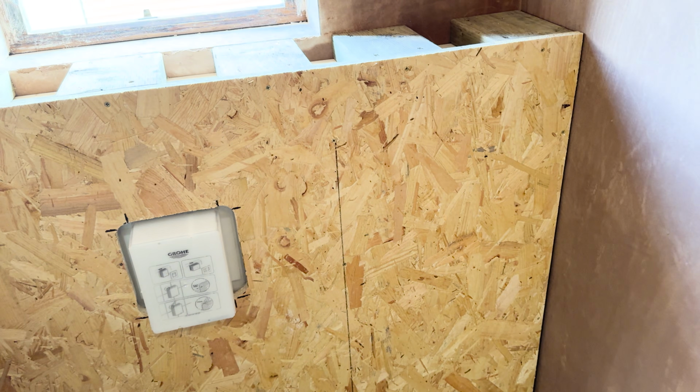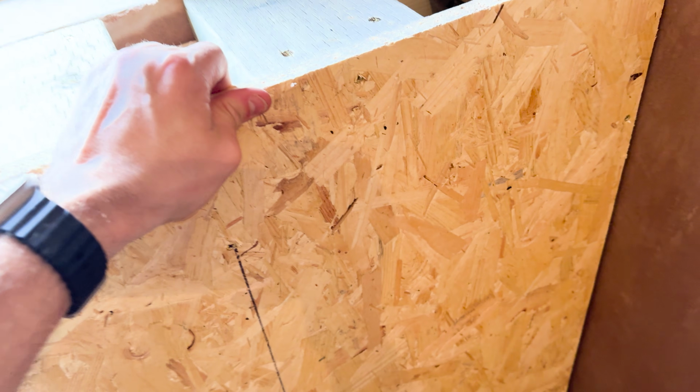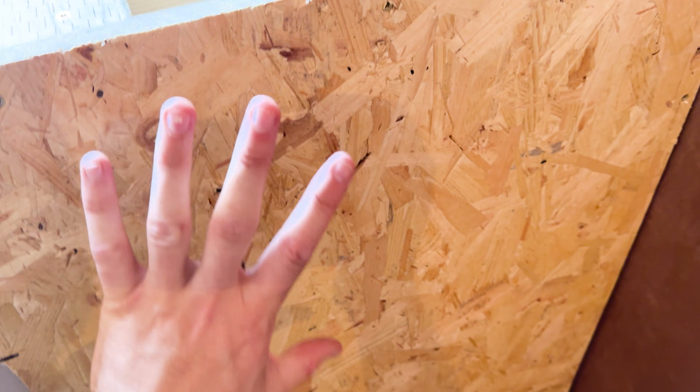So you know the drill now. Either a sheet of ply or OSB. I'm using OSB, it's cheaper. That strengthens this. So I've got the plasterboard on there. You can't just rely on the plasterboard, it's not strong enough. So you need something like that. Then the plasterboard goes on top of that, then the tiles. So it's nice and solid. When you sit in that pan back, there's no flex in it. So that's that. Let's go and bring up the drywall now.